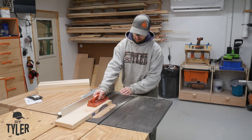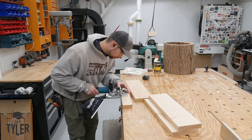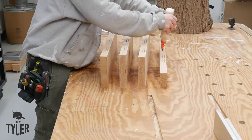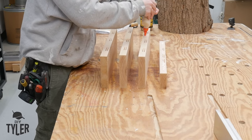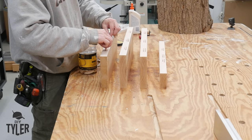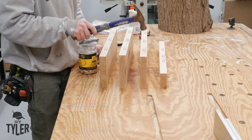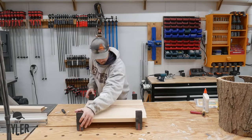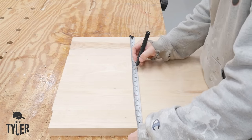We're going to surface the fourth side at the table saw, and then I got a biscuit joiner — I haven't bought new tools in a long time and wanted one because I'll probably be making kitchen tabletops. I'm quickly using the biscuit joiner to help with the alignment of this cookie. Why are there double biscuit joints? That was just a dumb mistake — I cut all the joints and realized the biscuit was too near the top and could show through the material. So I cut a new joint further toward the bottom. Biscuits don't add structural integrity but help you align the slab very quickly, making the glue-up faster.